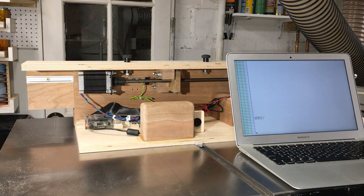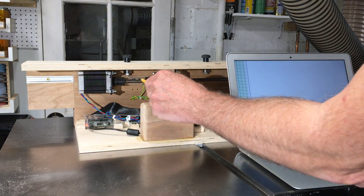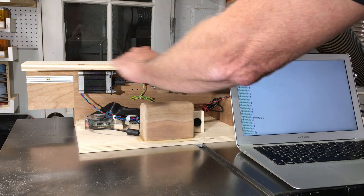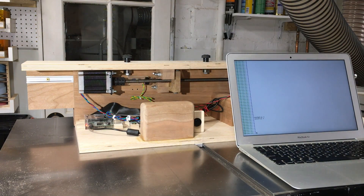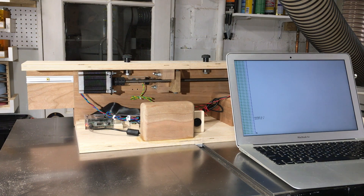You're looking at two computers here. This one controls this motor, which turns this threaded rod to move this carriage back and forth. It also connects to my home Wi-Fi, which allows me to use this computer — my regular laptop — as a control console. This computer has a program on it called 'box joint' and a bunch of simple files called cut plans.